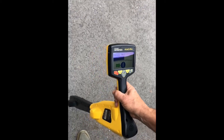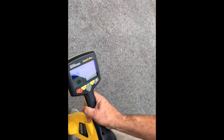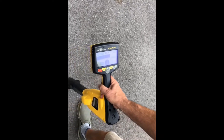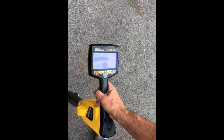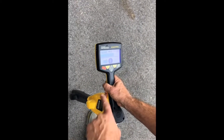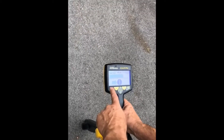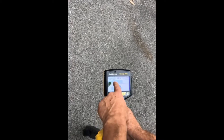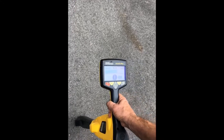Now we'll pick the receiver up and continue to walk. As we leave the area of distortion, the compass will turn green and the display colors will now turn green. When you see green, that tells you you have a far less distorted field. So the bars now turn green, which means this is a cleaner field. We're going to get a better, more accurate depth measurement — two foot seven. We're seeing about 5.7 milliamps of current, and the peak and null still works the same way.